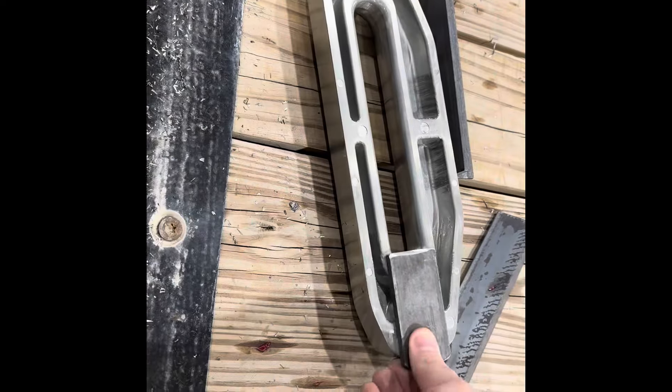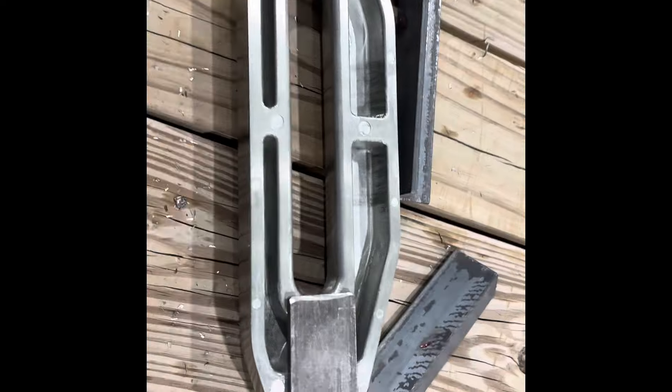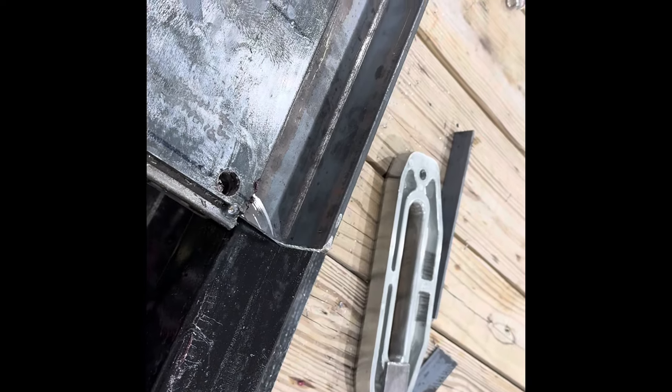The reason for doing it down the middle is we're going to send more heat into this solid two-inch bar that way. I've cut this guy to size, he'll live like this. We're going to grind away and get some of this goo out of the way that I used for lubricating when I was drilling. I'm going to grind that weld back just a smidgen. It'll tie the two pieces together when I burn the top and bottom. I made these two little tabs that are going to live up here, I'll send the bolt through them — beveled the edges a little bit so they look nice. It should hold plenty of lateral, vertical, and downward pressure on the fairlead without bending.